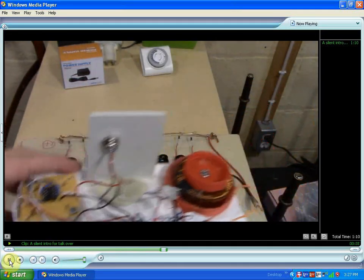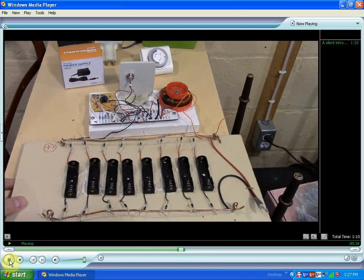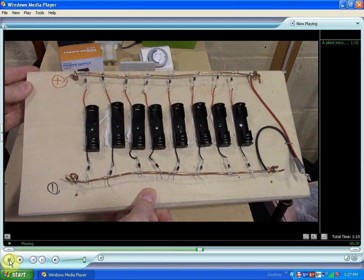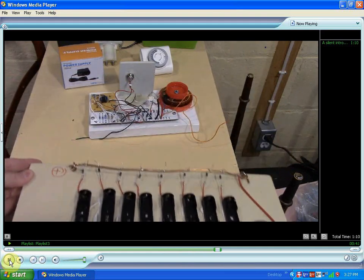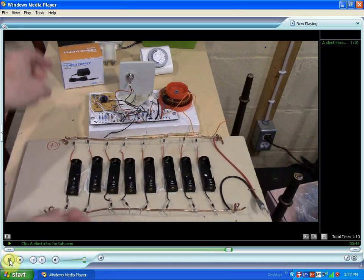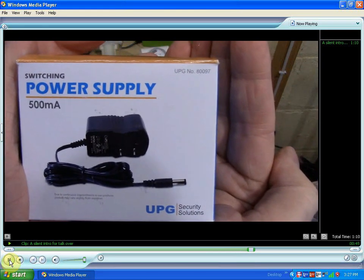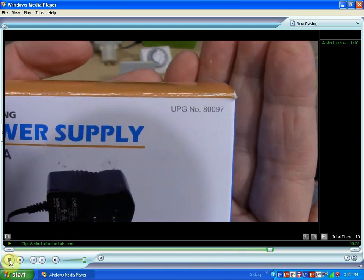The output of this charger is connected to a battery cradle like this one. I recommend just four battery holders for this circuit. Note the isolation diodes on each holder. I also recommend using this power supply to imitate my results — this supply has a flat and steady 12 volts. Home Depot has this particular model.